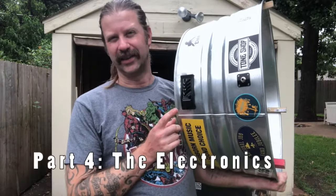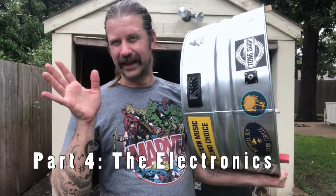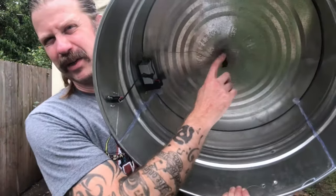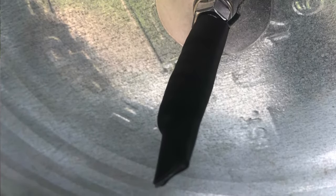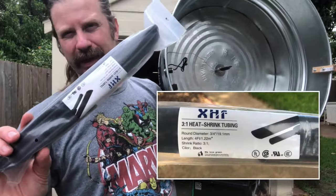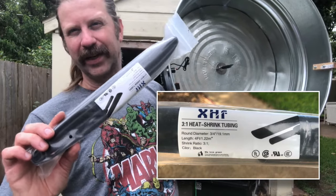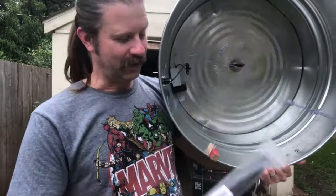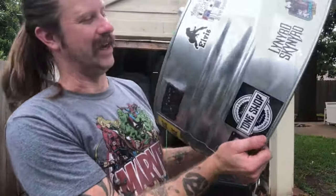The last thing I'd like to talk about is the electronics. I did a separate video on that and I love how it turned out. Right here in the middle where the bolt protrudes, I put some heat shrink around that — in the original video I just wrapped it with electrical tape, but I went back and put heat shrink over it and shrunk it down. I used three-quarter inch, three-to-one heat shrink tubing — just trim off a little piece, put it on there, heat it up and it sucks right down. I love that.